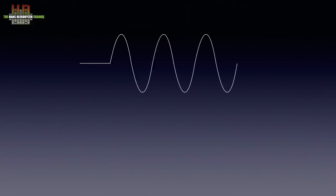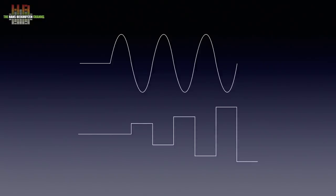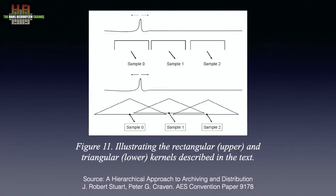These are signals that can start and stop. Let's look at a sine wave pulse. In most reconstruction filters a sample-and-hold circuit is used — it samples the average amplitude over one sample period and uses that value for further processing. This can lead to problems: there is a short delay, but that's not the real issue. It is the amplitude that slowly increases and thus ruins the transient behaviour. In his paper 'A Hierarchical Approach to Archiving and Distribution', paragraph 4.2 Reconstruction, Bob Stuart also mentioned this transient problem and suggests the use of triangular bins.